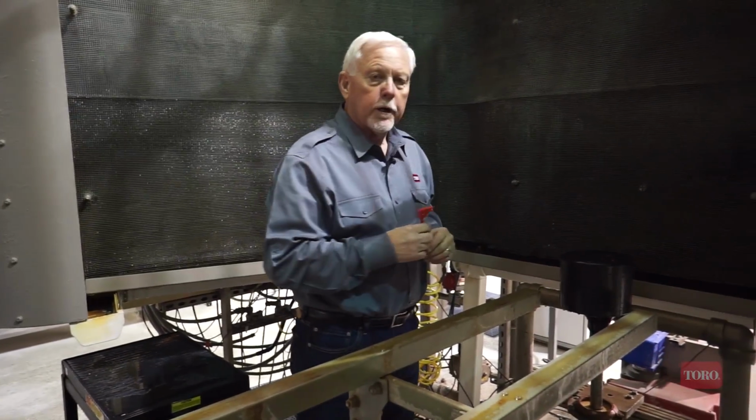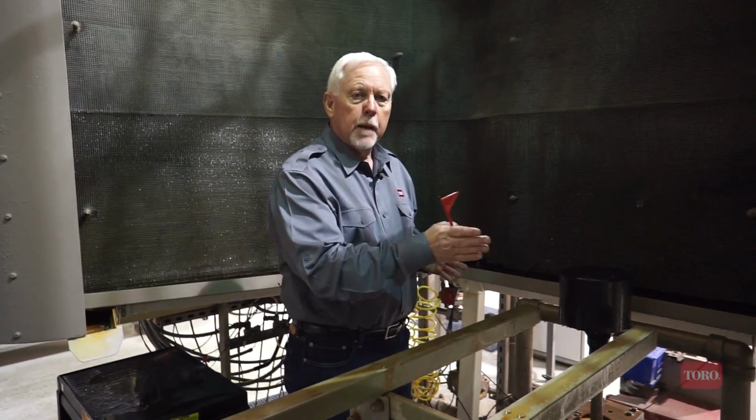Again, the ability to ratchet the riser to any position within the body without any disassembly: hold the gray band, turn the nozzle base clockwise to add arc, counterclockwise to decrease arc, and the ratio is 1:1. The amount that I turn the nozzle base is the amount that's either being added or subtracted from the existing arc.